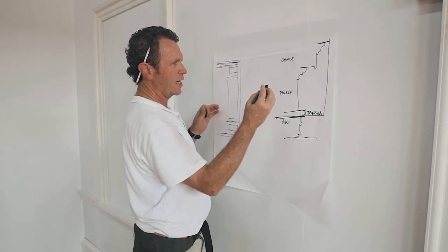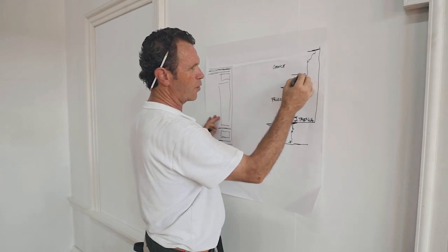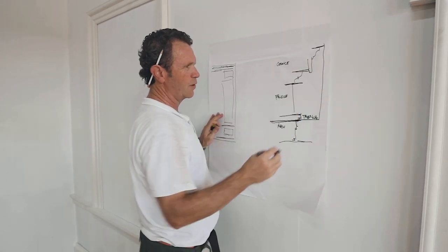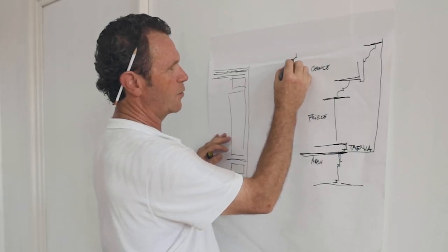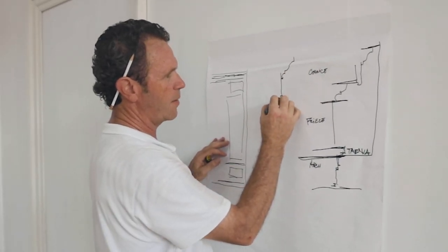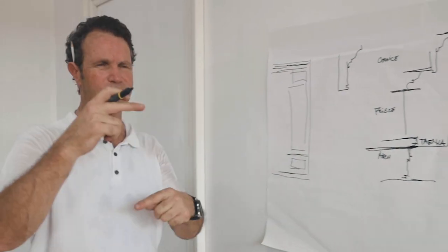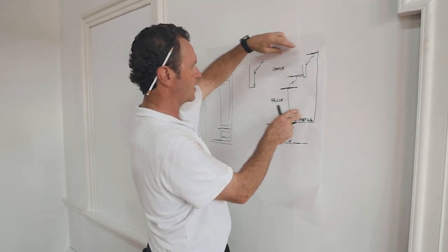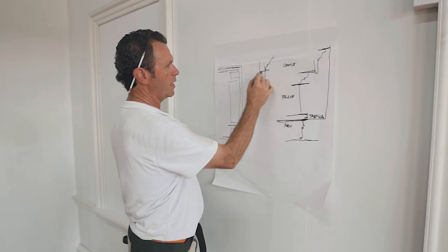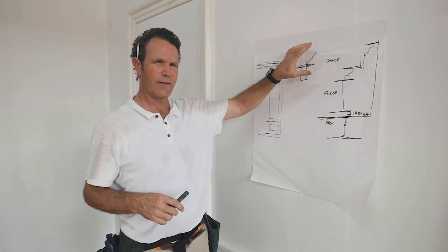And then for secondary areas, you can just do the cornice. Or you're just going to do this four-part molding. I'll show you those different moldings. Both Kewkin and Windsor have those. And then for upstairs, you might go with the crown and then introduce that beaded casing again. So that you might come down, I don't know, 5-6 inches, but in those bedrooms, depending on how elevated the rest of your house is, you may need that. All you may need is just that crown. Some rooms, and in very simple houses, you wouldn't even have that.